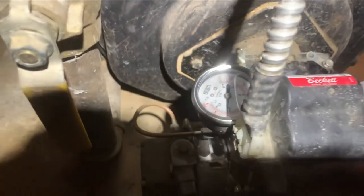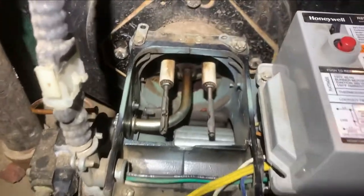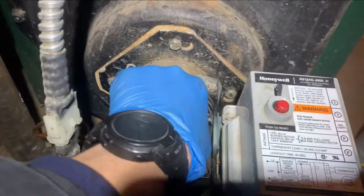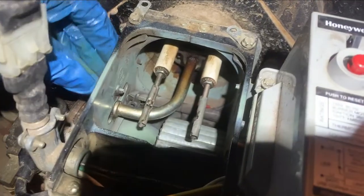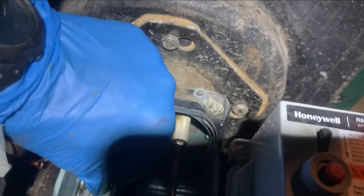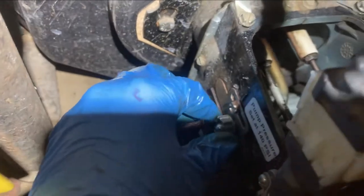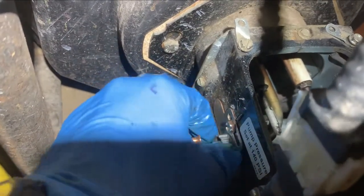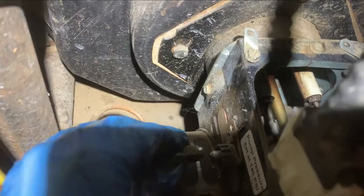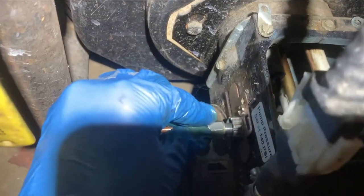To put this back in, I just maneuver the nozzle line in there, the side goes through this hole right here at the end of the tube, and this nut just screws on there. You can do hand tight for these, and then I'll put this flare nut right onto there and tighten that with the 7/16ths.